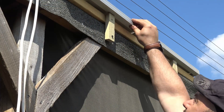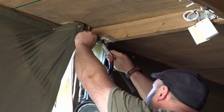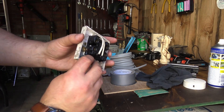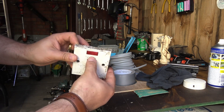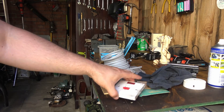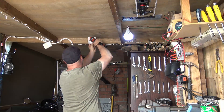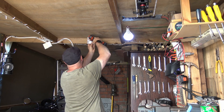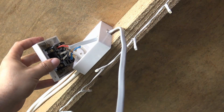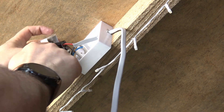I put these here to stop the panels from blowing away in any strong winds - we do get some pretty strong winds down here. Digging through my racking I found this filthy filthy switch. I'll test that it works and give it a clean up. Also found a bit of twin and earth cable. We're going to put the two solar panels in parallel - 20 volts is about as much as we want really, and that'll give us 20 volts at 4 amps. That's not bad. It's a solid copper twin and earth cable and I'm wiring that in now.